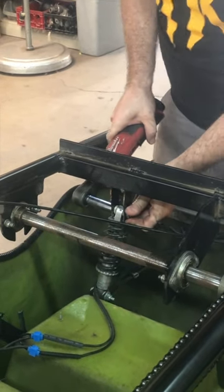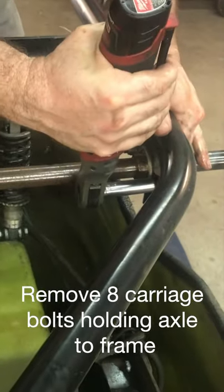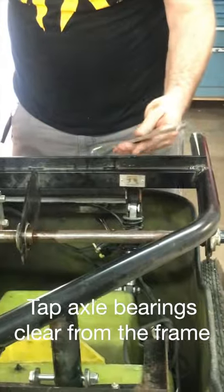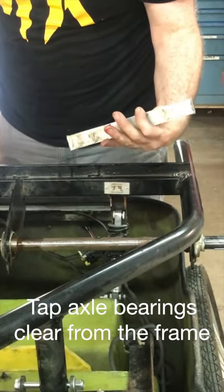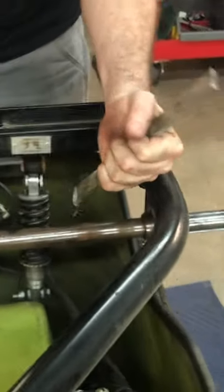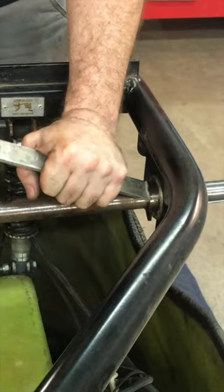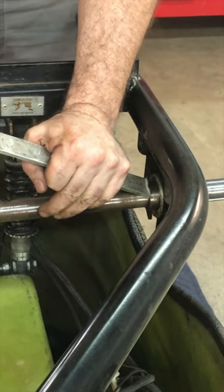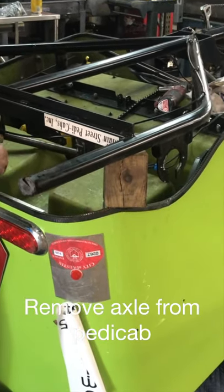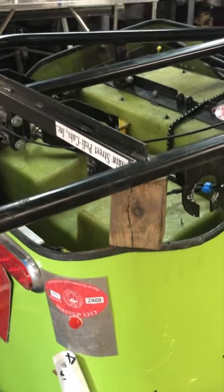Don't forget the other side. Go ahead and loosen the mid-drive. I like to use this aluminum flat bar — it's one inch by quarter inch or 3/16 — and because it's aluminum it's softer than the steel of the axle, so when you go banging on it it's not going to put a dent in the axle. You can try the block in various spaces to give you room to pull the axle; this seems to work pretty well but you've got various options.